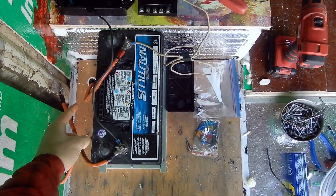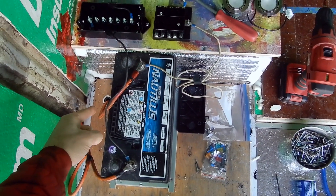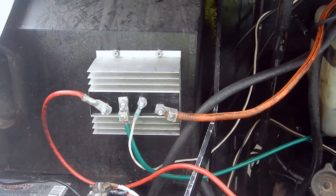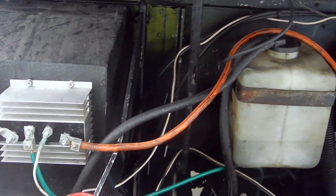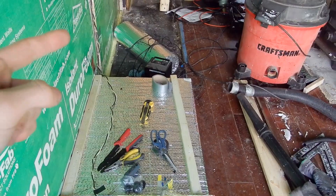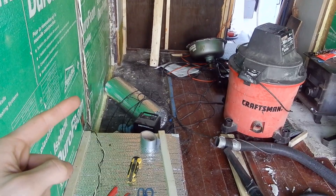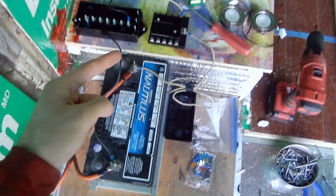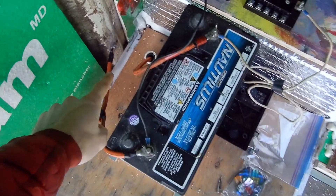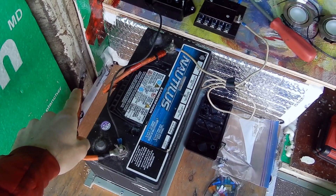In the corner here is a little bit of hose that runs to the underside of the vehicle, and this cable here runs to the front to the battery isolator. There's a 60 amp inline fuse there — I used to have it up in this corner but that position didn't make sense, so I moved it back here. The negative is grounded directly to the aluminum frame of the vehicle.